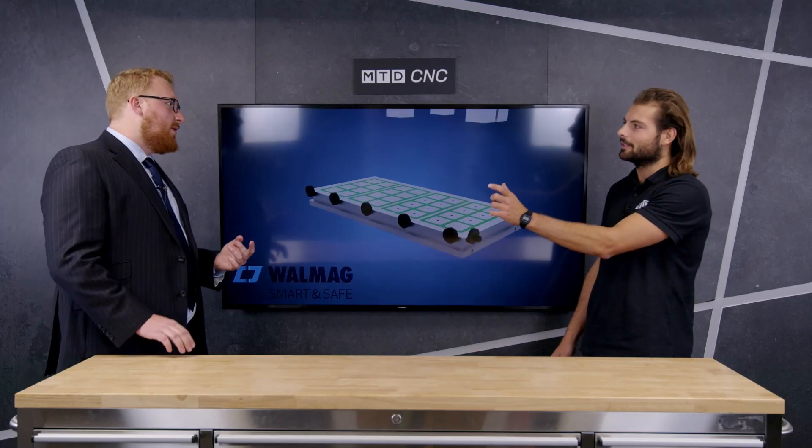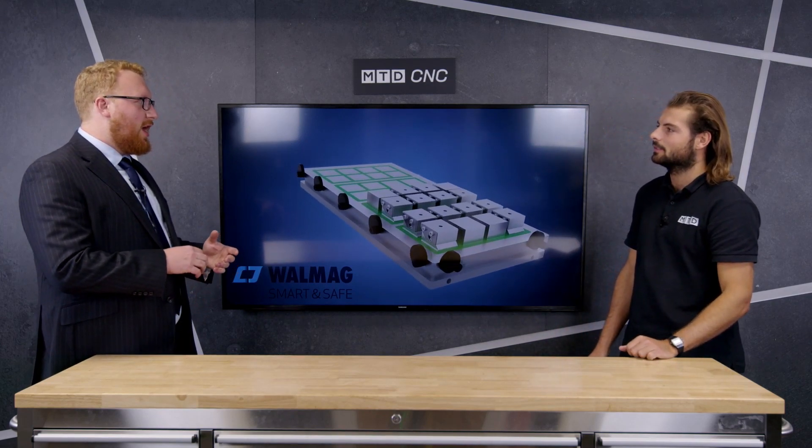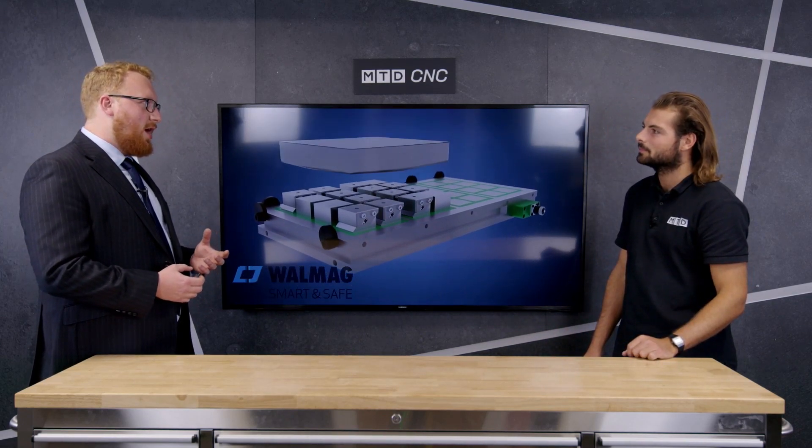And what's the difference between those, please? The permanent magnets are very much lever operated — manually actuated. They have a lot of advantages in terms of flexibility; it's easy to take on and off of the machine or move to different machines. You obviously don't have to take a controller with you, so it makes life a lot easier. Those come in both milling and turning options. It's an all-in-one solution — no wires coming out of it, just a single lever. You clamp it down. Very easy to use.